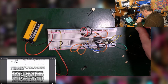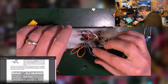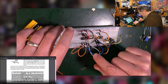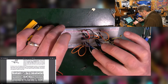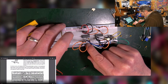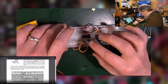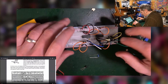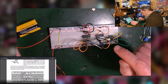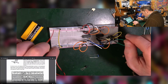So we've removed the 100k resistor because that's no longer going to be there. Gotcha. Right. Okay. Removed that. Now some of the components have moved around on the breadboard, does that matter? Trying to suss this out. They've moved the diode to the other side to fit in there, I think just because it's neater, not because it's doing anything. So I'm going to pull that out of there, put it in here. I've just shuffled it down this strip. Those are all connected, and it all still remains the same. I've just moved that over there because that resistor is no longer there, so I have space now to put that diode that has come out. Is that going to cause things to break? Let's hope not.